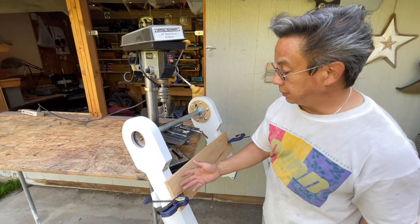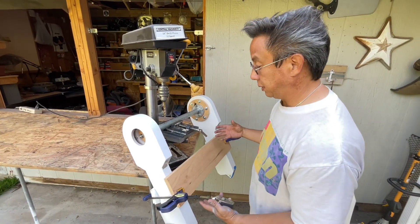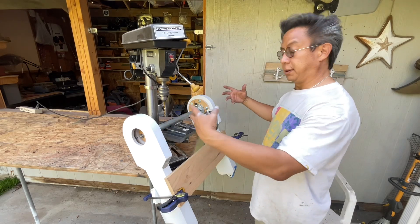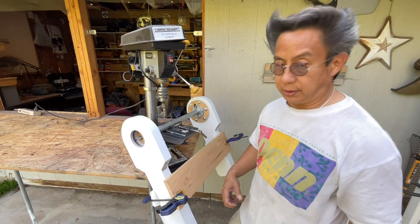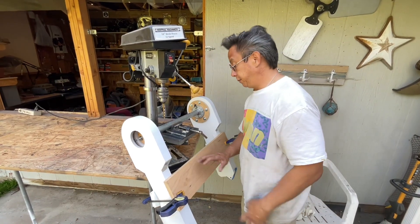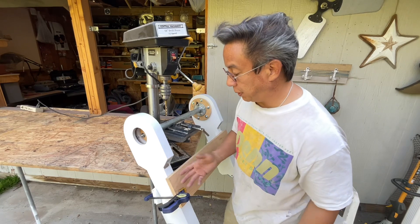it's as simple as taking a straight piece of board and just clamping it onto your legs. Then you'll know the legs are completely parallel with each other. Of course, make sure you use a nice straight piece of board, and it's probably better to do it before you paint it.